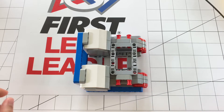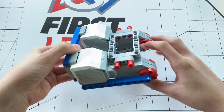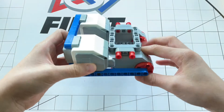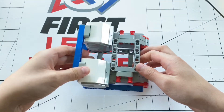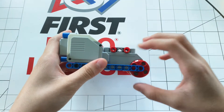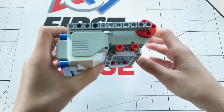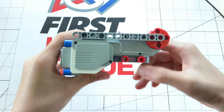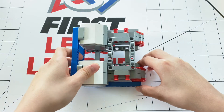For starters, let's talk about by far the most popular way to align your motor assembly in your FLL robot, which is flat. The reason many teams use this is because it's very basic, and it's what you find in the instruction manuals of most FLL robots. This alignment is so basic because almost any wheel can be used and you can place a wheel right here and it will be able to make your robot run. With other alignments, you will have to have special wheels.